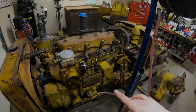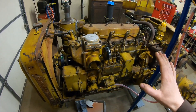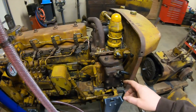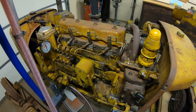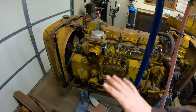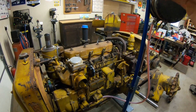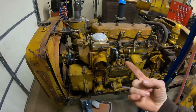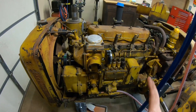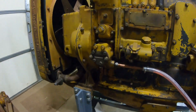Just by doing the gravity bleed like this, we've got 90% of the air out of the fuel system already. It really cuts down on the amount of time required of the starting engine to crank the diesel during our initial startup attempt — completely worth doing it in my book. I've let this sit for a while now with the gravity pressure on the system, just trying to prove everything out. And as usual, we've got a leak. Would we expect anything less at this point? No.